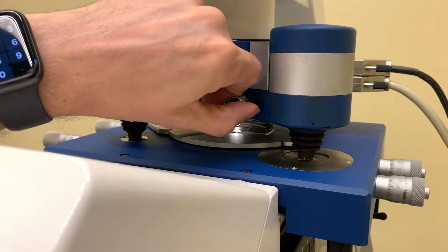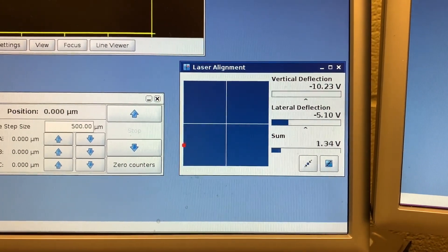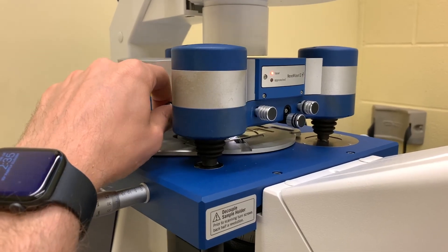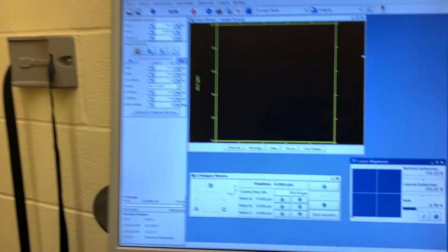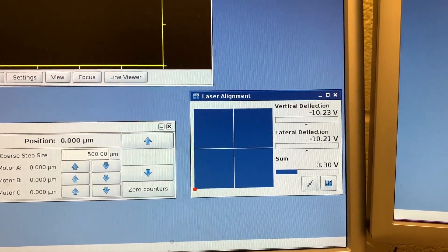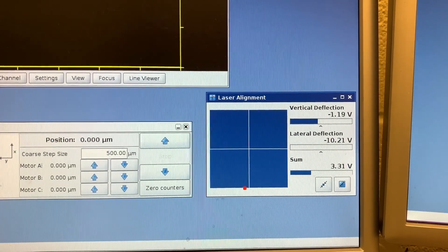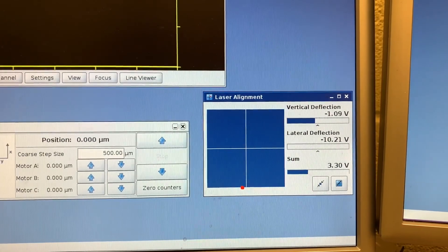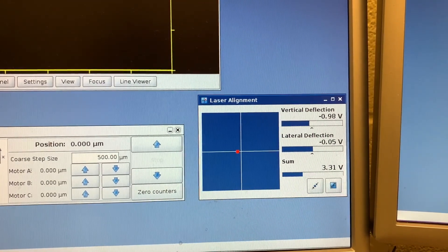To begin alignment, we first manually adjust the position of the laser relative to the AFM probe to make sure it is properly striking the cantilever. We rarely adjust the position of the mirror unless we are using different brand probes, so we should get a visible change in the overall signal sum when we strike the cantilever. Next up, we adjust the position of the photodiode to define a starting point of the laser spot on the four quadrants. I know I'm moving the photodiode in the right direction when the sum value increases — if it decreases, I know I have to turn the knob the other way. The set voltage for vertical and lateral deflections are minus one and zero respectively. We want the laser spot to be slightly offset to the left to maximize the signal generated by the laser spot moving vertically up and down on the photodiode, so we don't want it stuck between two quadrants limiting the voltage generated.